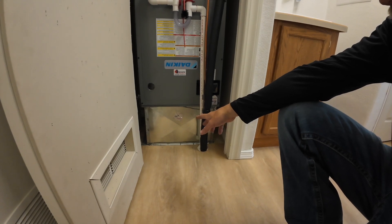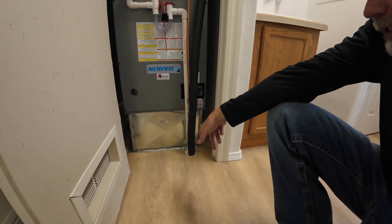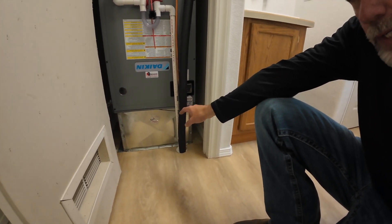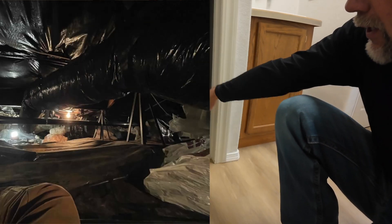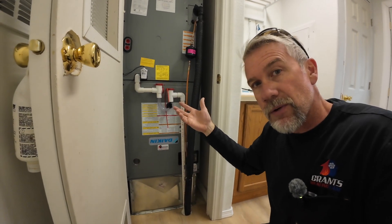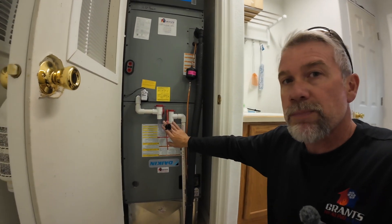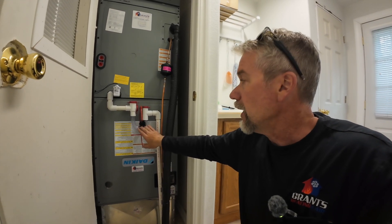The reason we built the custom box is because the opening in the floor is towards the back and a little bit off center. By building this box, we also bring our heat kit up safely off the floor and allow the air to go down and disperse properly into the main trunk line. Below that we added the 10-inch flex to bring air to the other side. We have a P-trap, of course, because this is a negative pressure downflow application — everything's turned around, which is why you see the Daikin stickers upside down. We do have to do a slight conversion for the coil; the coil gets turned around. It's important to use a clear P-trap so we can see if it's getting full of any debris and make sure that gets cleaned out — very easy with these caps to clean.